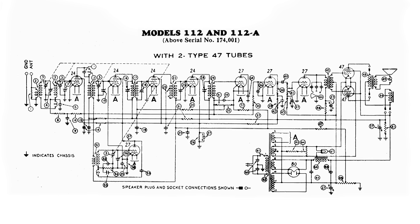If you look all the way to the left you'll see the antenna and the antenna coil. This RF energy gets magnetically coupled to the secondary. In the secondary you'll notice that there is a variable capacitor, and all this energy gets magnetically coupled to the next coil, which also has a variable capacitor.